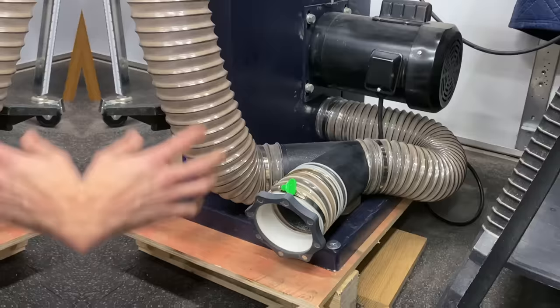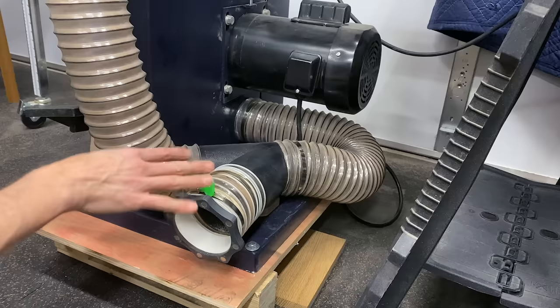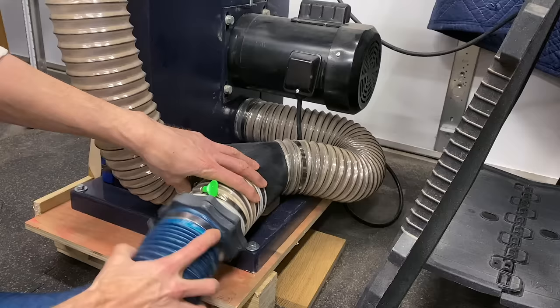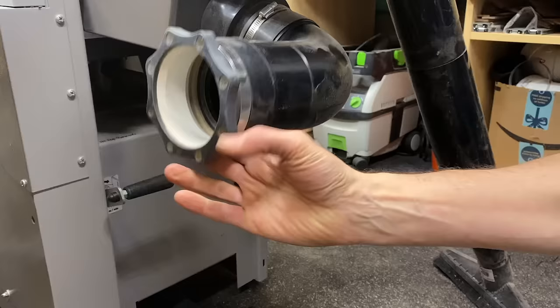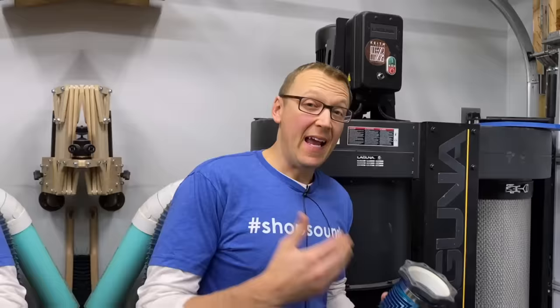Let me show you how I hook this up to my joiner planer and the bandsaw. The bandsaw has two dust collection feeds: one that goes to the bottom of the table and one that goes around the back to the bottom compartment. I had some flexible hose and came off with a tee, and from there I hooked up my Magport dust collection fitting. So I can just bring over my flexible hose with the other magnetic fitting on it and I'm hooked up. When I need to change machines, a twist and I'm off. Then I basically turn three feet to my right and there's my joiner planer combo dust collection, which also has the Magport fitting hooked up. Hook that up, do all my milling and jointing, and then just disconnect.